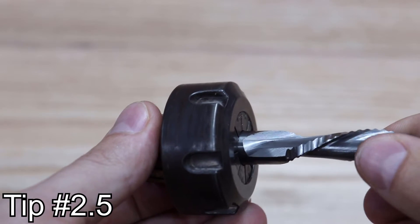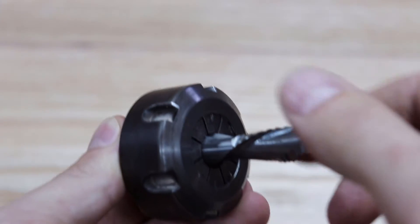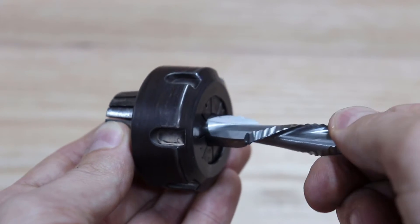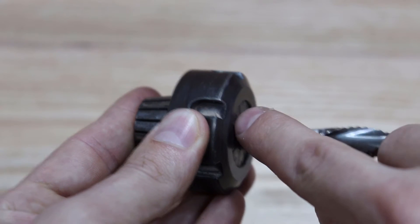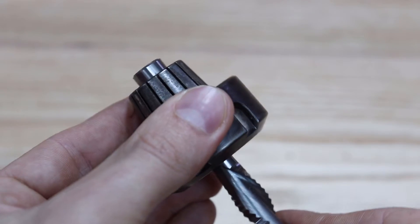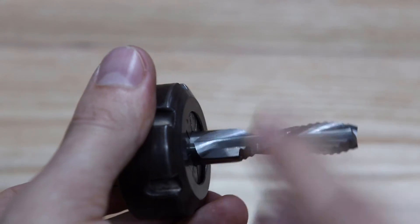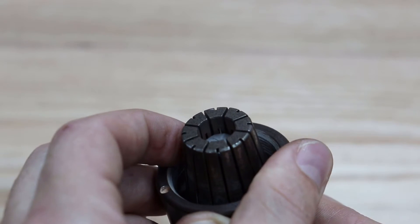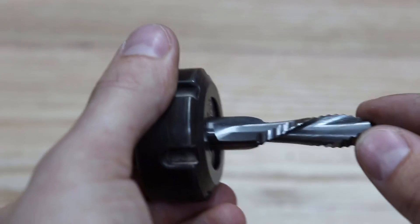I get asked this a lot — how far do you insert the bit? You never want to insert the bit so far that the flutes are actually inside the collet. That is very bad. You want to insert it to about a sixteenth of an inch or one and a half millimeters outside where the blade is not inside the collet — that is the proper way to do it. If the flutes are inside of it, the bit's going to break. For this particular bit, as far as it can go in it's stopping about a quarter inch or six millimeters away, and that's okay because the flutes are not inside the collet. This is going to help improve the life of the bit and improve your cut.